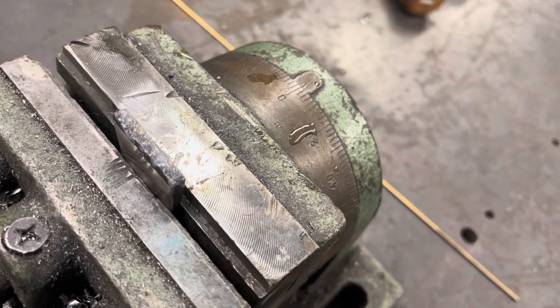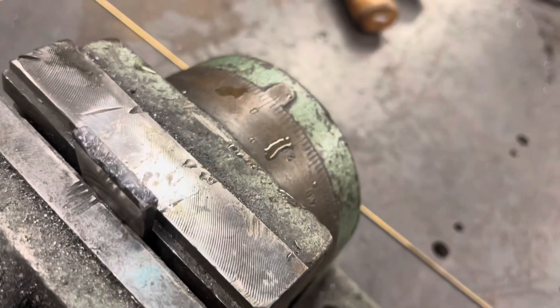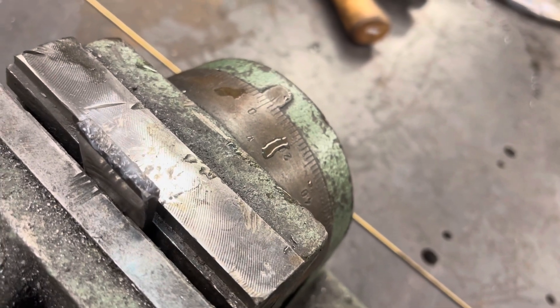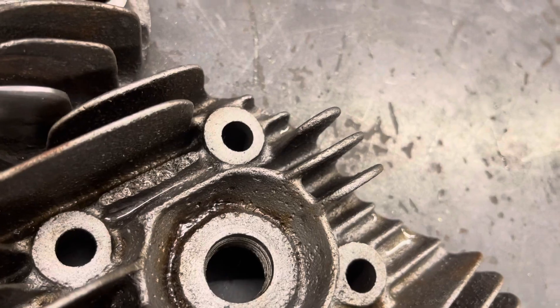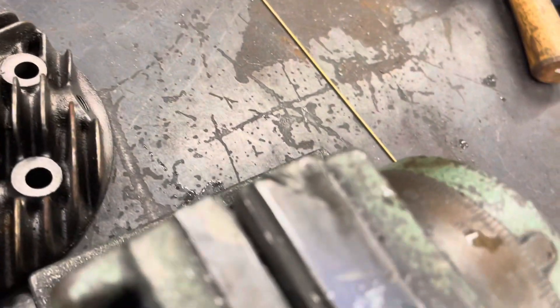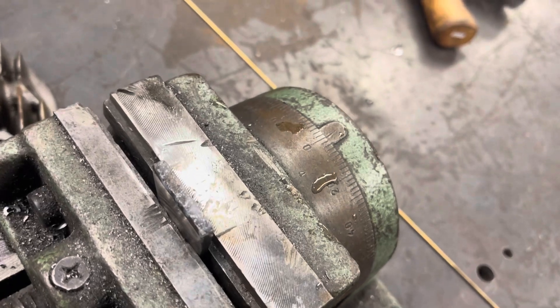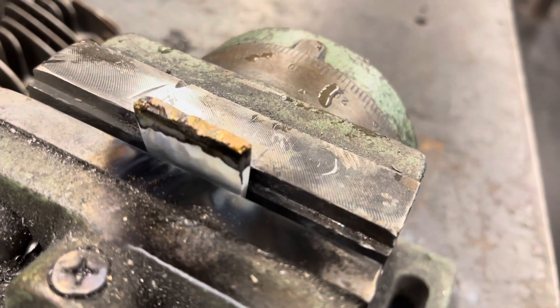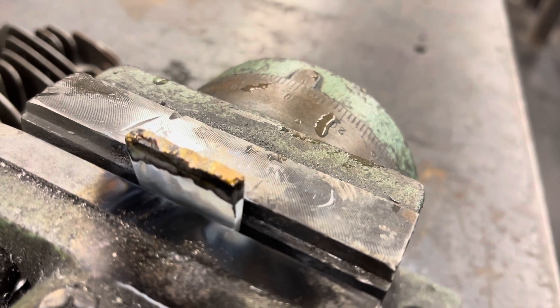How I'm going to connect this fin to the head: I'm going to bond brass to the part of the fin I made, which will bond to the head. And I'm going to bond brass right down there in the head itself. I'll bond brass to that broken fin, then put the two pieces together, heat them, and add some brass filler rod. That'll give me a good brass-to-brass bond. The bottom of my fin patch piece is covered in brass, and I'll do the same thing to the head.